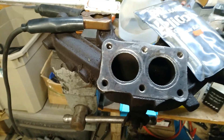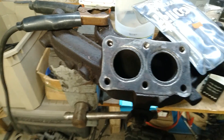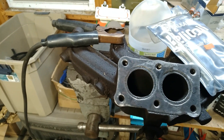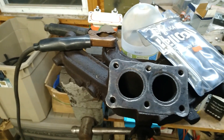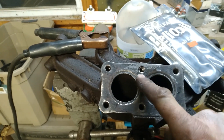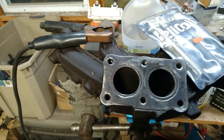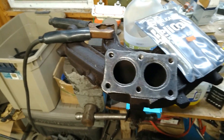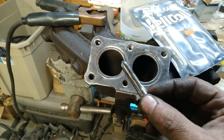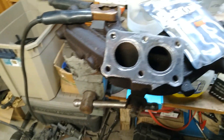Now, if I was doing this right I'd have put some thread lock in there just to keep it from backing out, but it's not going to go anywhere — I'm going to put a stud in here. Unlike a screw where there's friction against the threads when you tighten it, when you have a stud it's just solid and all you're doing is pulling on those threads. I want to be kind of careful with it. The other way this could have gone horribly wrong: when you tap it out, the kit comes with the right tap, and whenever I tapped that out this could have broken off in there — that would have sucked a lot. Don't let that happen. Thanks for watching.